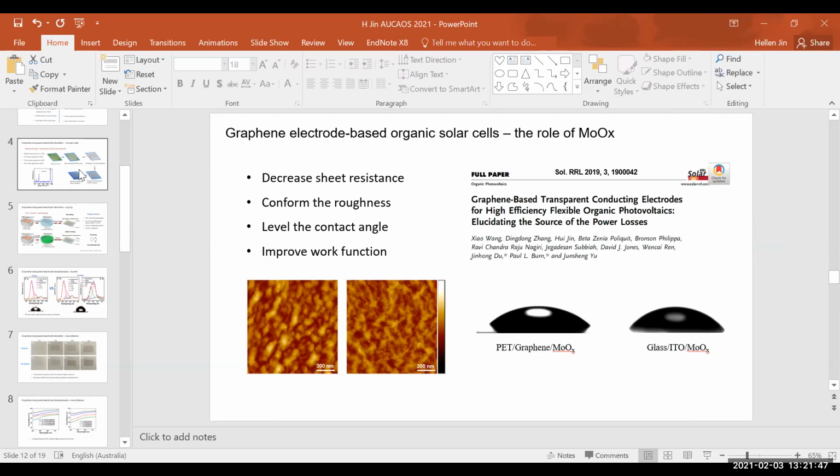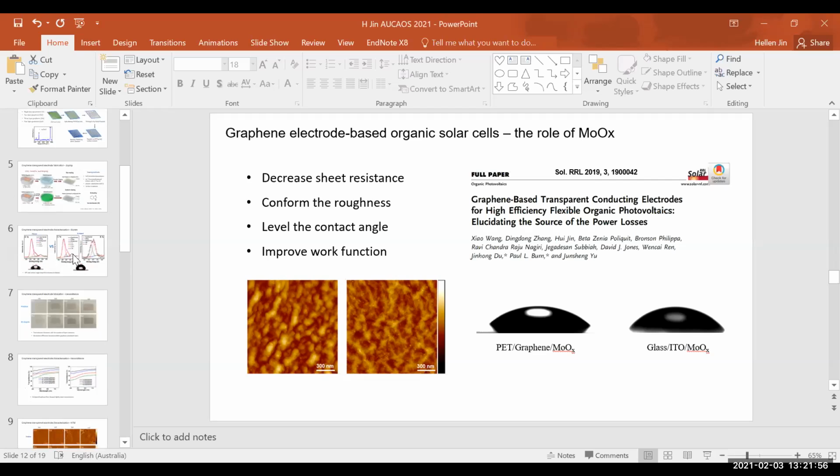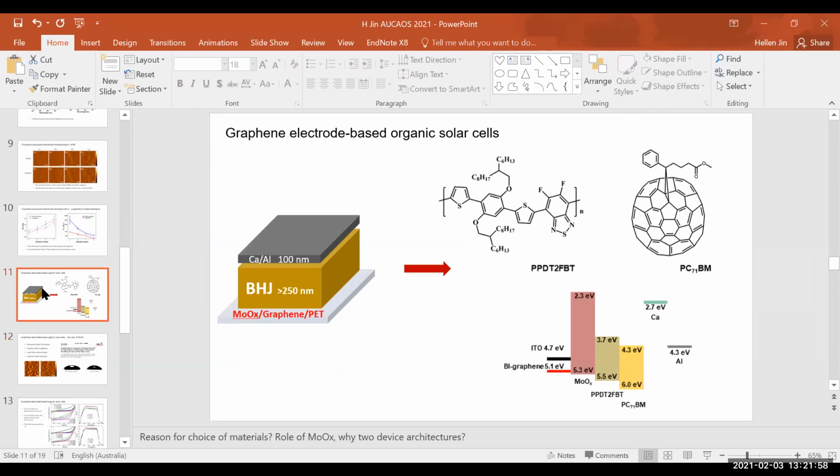Yes, I do have a question regarding the thickness of the active layer. How would the stability and efficiency be affected, or how different will it be if the thickness of the active layer is reduced? And secondly, regarding the N and K values of the active layer, how has doping using graphene affected the N and K values?